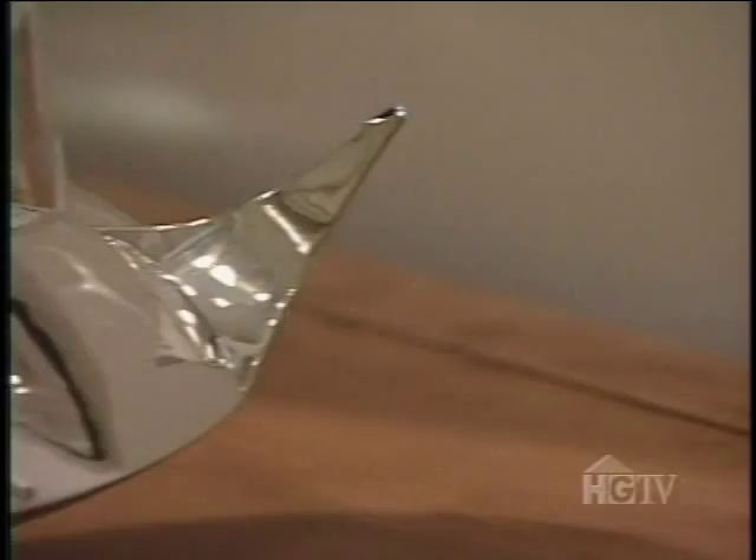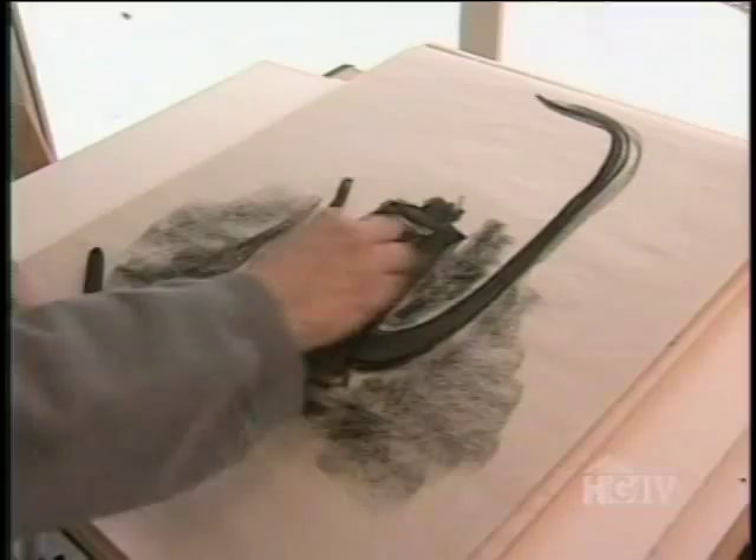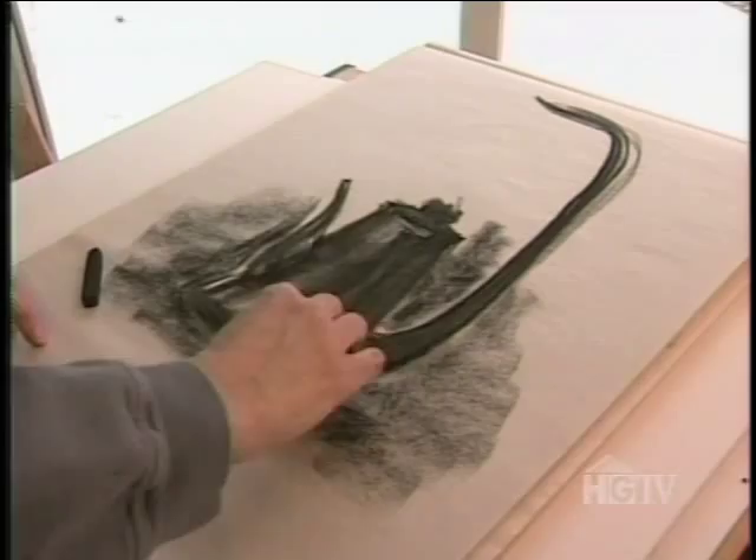Their improbable long-stemmed handles started to grow a couple of years later, inspired by a piece of jewelry. 'I made these big collars that came around the neck, and one day — maybe a year or so after we made these — we took one apart and Maureen held the two pieces against the teapot and said: handles.' Today Maureen is sketching a single-handle design. From Maureen's drawing, Michael creates a pattern, traces and cuts one side of the teapot body from a sheet of heavyweight sterling silver.